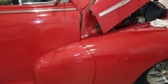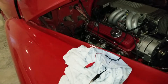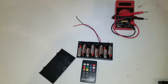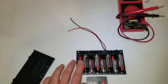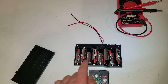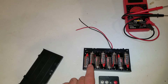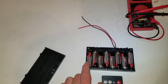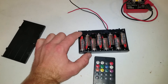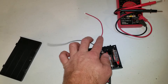I didn't really want to rewire all my LED light strips, so I tried to find another way. Amazon sells these battery packs for AA batteries. The way this works is this whole pack — when you add 8 1.5-volt AA batteries, it equals 12 volts. They're wired in series, so you add the voltages to each other to get a result of 12 volts.